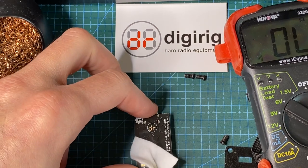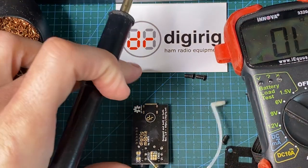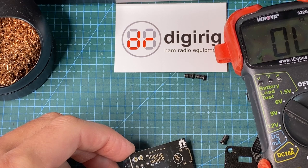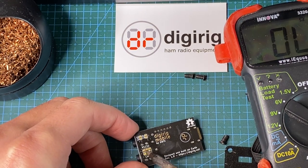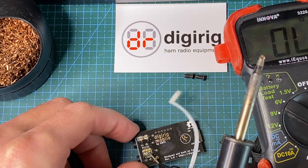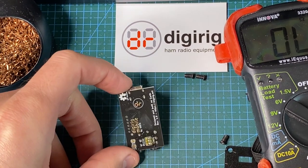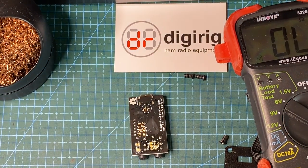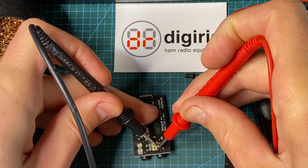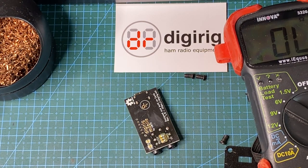Okay. So next thing we're going to look at is if we need to remove the configuration and revert it to the logic level. What we do is remove the solder jumpers that we added, like so. And then we put the solder jumpers where they should be initially, in the default configuration. Okay, and we make sure there's no other connections there. Again, important to make sure that there are no unwanted connections, for example between the adjacent solder pads, and we're good.